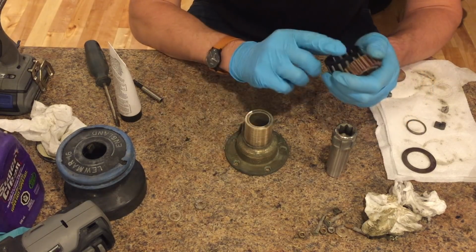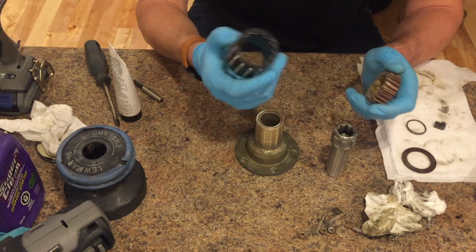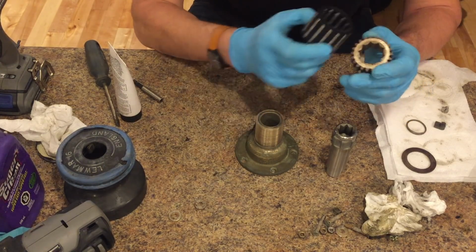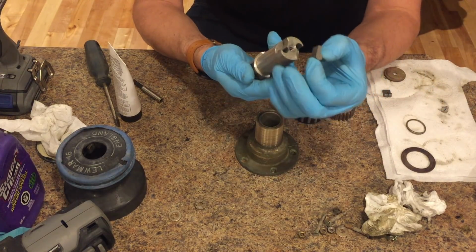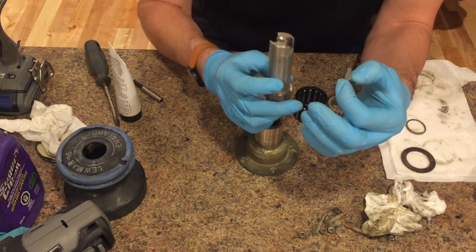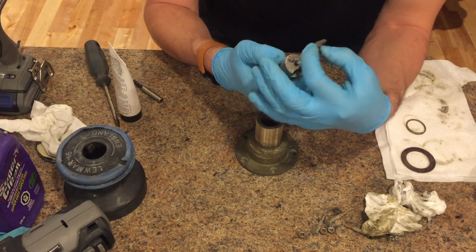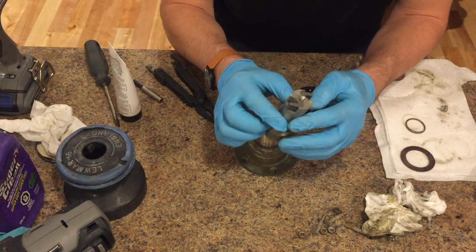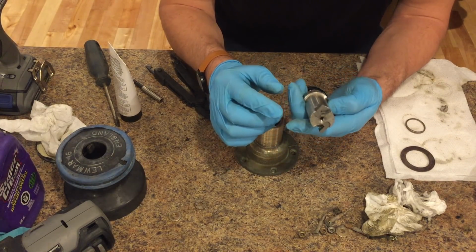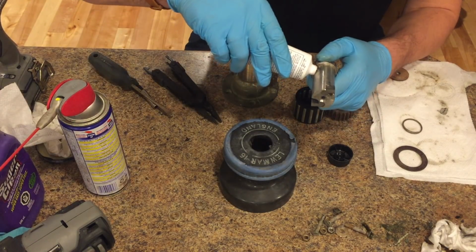So when you try to grease your winch, make sure that you grease the bearings and the gears, but do not grease the ratchet portions of the winch. That is to make sure that the ratchet parts do not stick and they work properly. Don't take me wrong, these do need to be lubricated. Just use the machine oil and it will be okay. Put only a moderate amount of grease on.